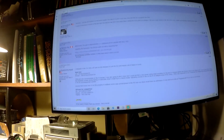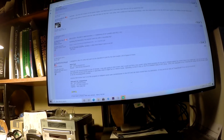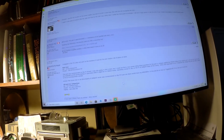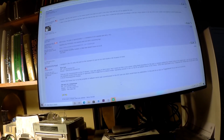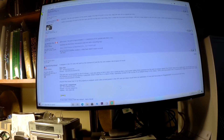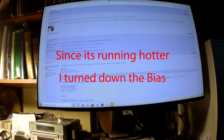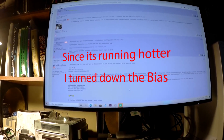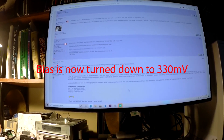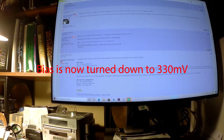Also, I had previously used E6000 and found the heat on the MOSFET caused it to just shrivel up to nothing. So I went back to good old regular RTV silicone seal, and that seems to be holding up much better to the heat of the MOSFET. I think this is all around a better way to go, and so I've done this video.